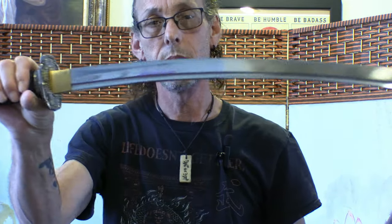That's a nice little tidbit — whatever your sori is, add it to the length of your blade and that's roughly how long the blade actually is. To find the sori, it's a very simple process: lay the blade down flat — taking the handle off makes it easier. Lay it down from the point to the habaki, because they consider this part of the blade.